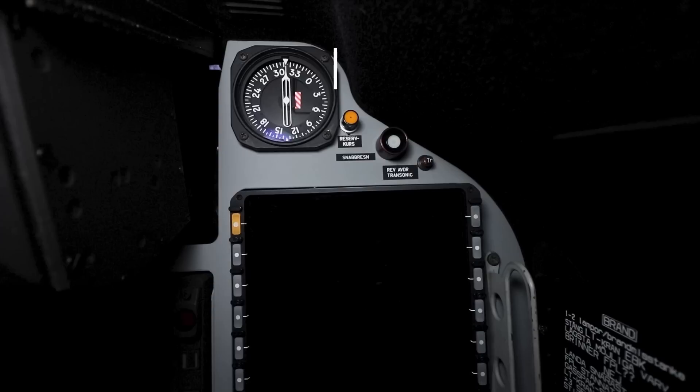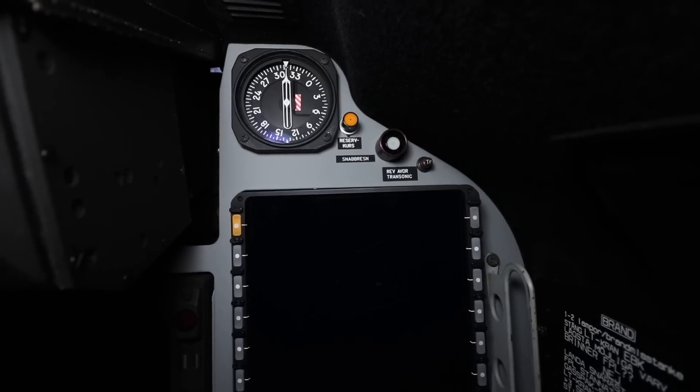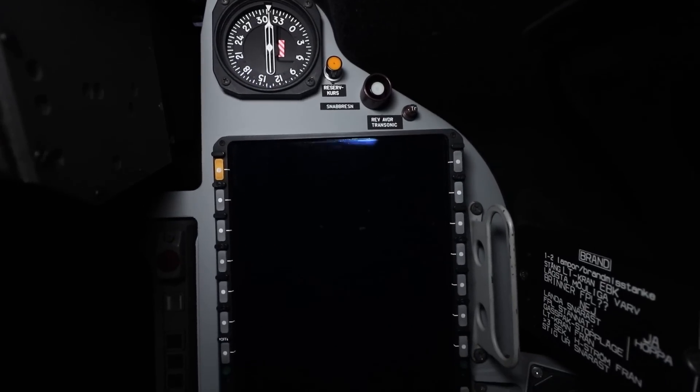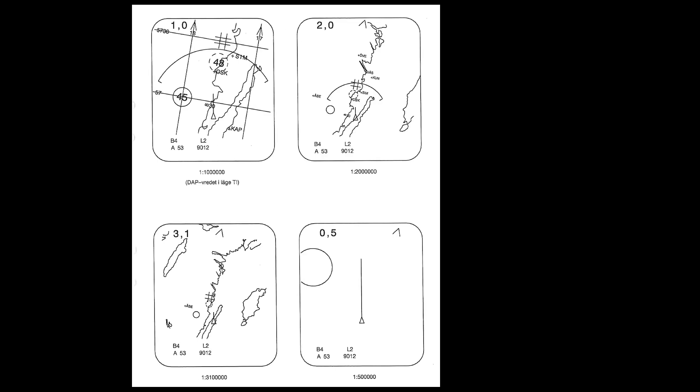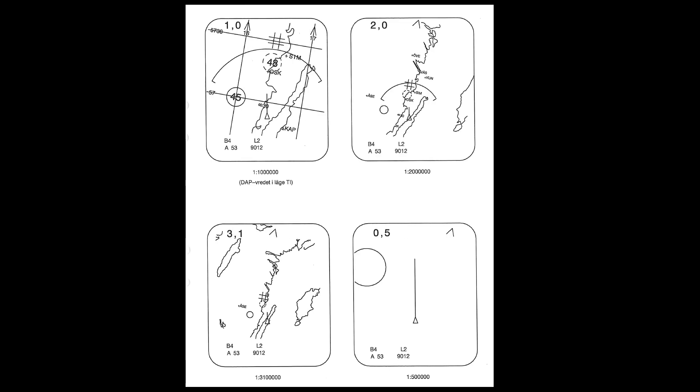The arrangement in the DI is a lot different than in the Viggen D, as the right heads-down display doubled in size, and other panels and gauges had to be moved. From the left we find the standby attitude indicator over the altimeter and backup altimeter. Above the main attitude indicator we have the accelerometer to the left of the speedometer, which also has an integrated Mach counter. The angle of attack indicator is on top. Below all of this, this Viggen has an engine RPM indicator and an engine pressure ratio indicator to the right — moved from the earlier D versions. We then have a central heads-down display: the target display, used primarily for course and attitude and anti-collision warning. Above all this you find your heads-up display. To the right and top, a heading indicator, and then the second larger heads-down display below — the tactical display, primarily used for navigation, aircraft position reference, target and location markers.